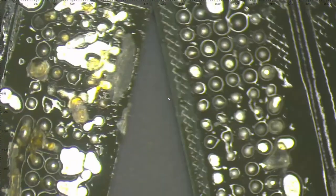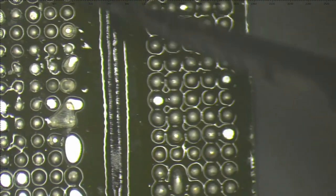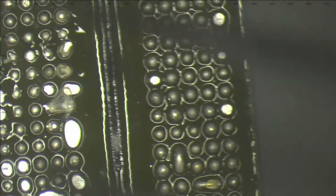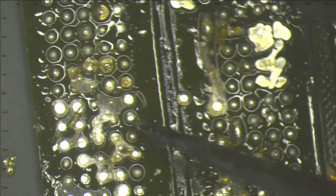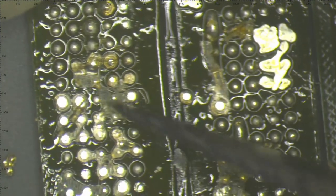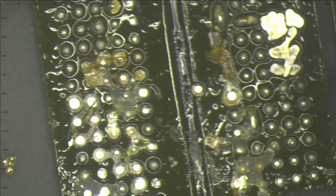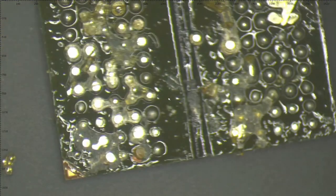So, can you tell the difference? This is the second RAM chip. And my flux is completely fresh, so it's perfectly melted right here. And right here, there is some residue from the old flux, which is completely hard. This one. So this part is also missing right here on the bottom.